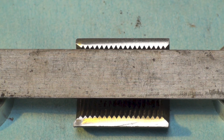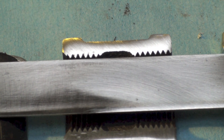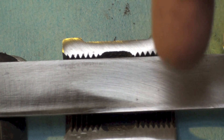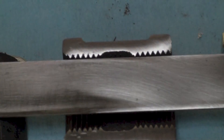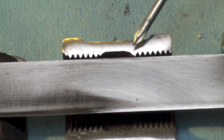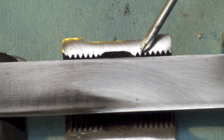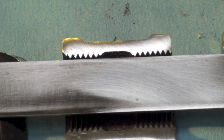Let's take a look at a real coupler. Here we can see the difference — this coupler has threads coming from both sides. They've taken a tapered tap and run it this way, then another one back that way. You can see that down here the thread has a smaller diameter than it does up here, and the same on the other side. It's fairly subtle, but it's there.